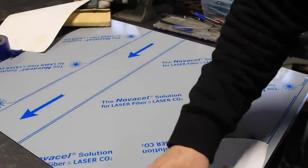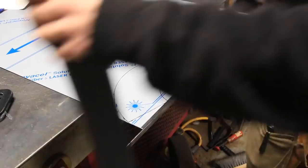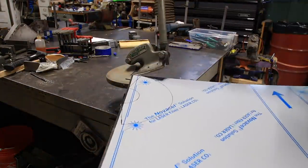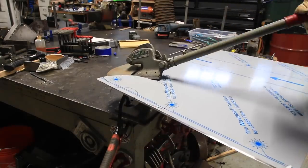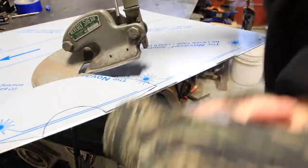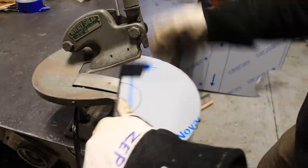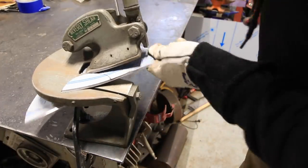Once I had the shape figured out on paper, I grabbed some stainless — this is left over from a backsplash that I had done. This is I think 20 gauge stainless steel I got from Online Metals. Stainless in general is a lot stronger and has a lot more resistance than mild steel sheet. I'm using my Beverly shear here and it's definitely given me a little bit more of a fight than you would with mild steel. I want to make this something I don't have to worry about getting rusty, and also because coffee is extremely acidic it would just immediately eat right into mild steel.